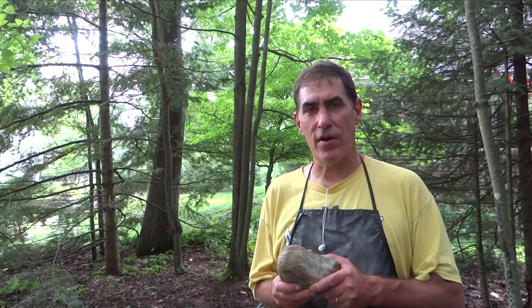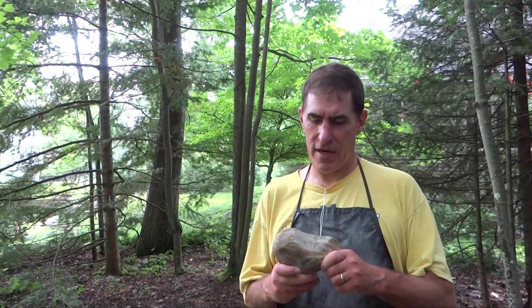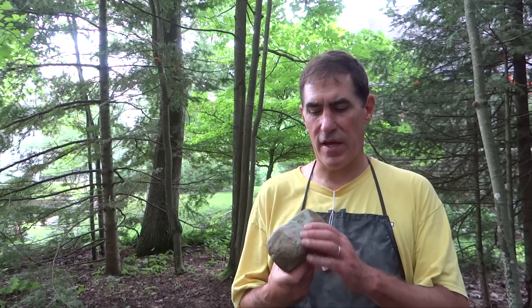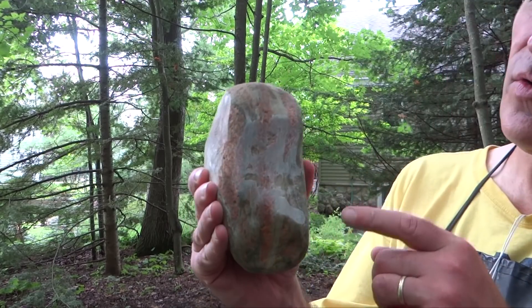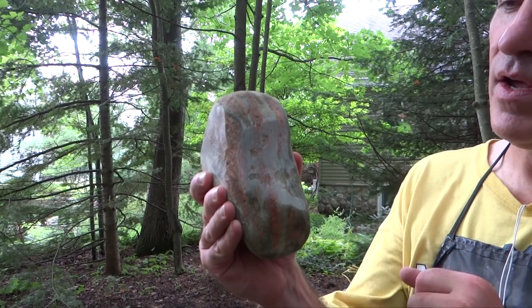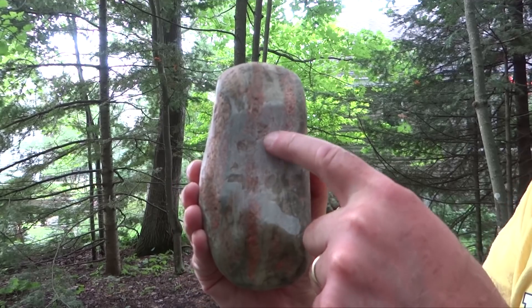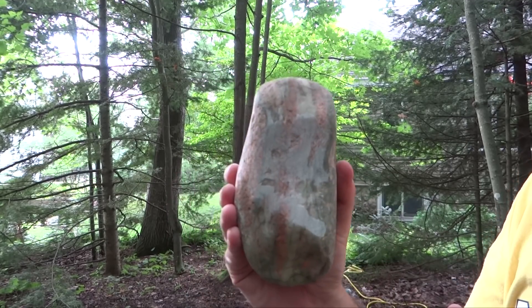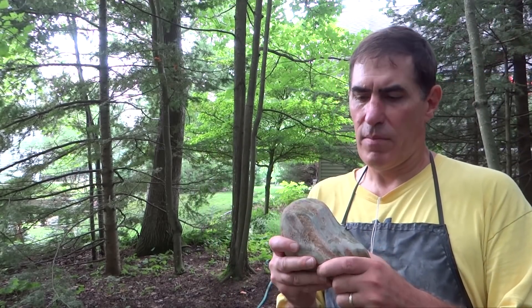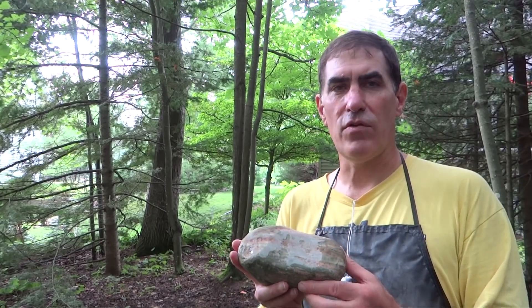This is the first one of these rocks I've done all summer with the grinder. Outside, I've done everything else with tumblers and smaller stuff. I forgot how much more effective that hard wheel is on this stuff than the soft wheels. With the soft-backed diamond wheel, I just hit this for a couple minutes and it's not getting into any of the low spots at all. It would eventually, but going over the whole rock with that is going to be pretty slow. So I'm going to go back to the hard wheel and do the entire outer surface.